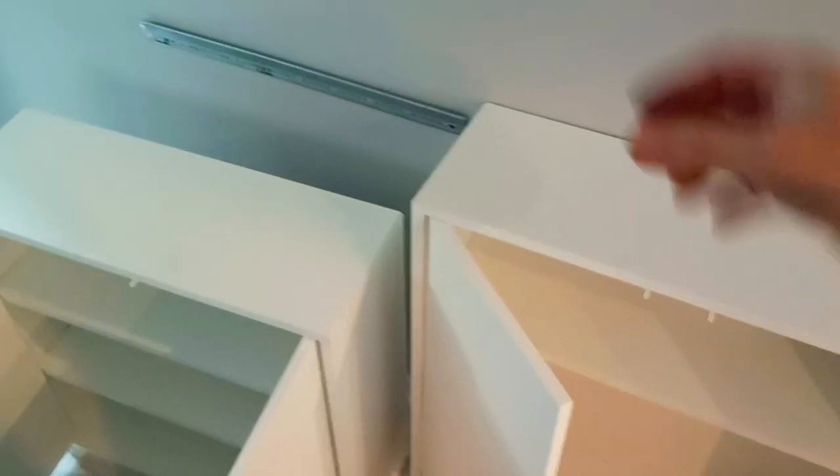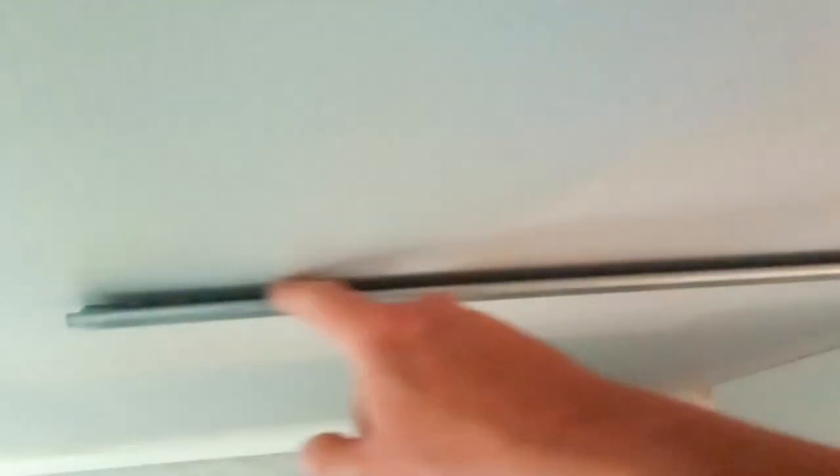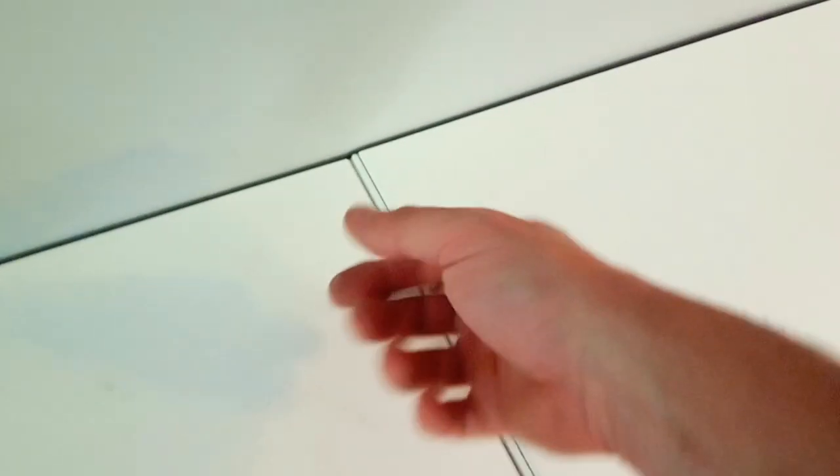Three of the screws are in, so now let's put on our cabinet. When you're putting the cabinets on your rails you're going to hear it click. The idea is to put the screws behind here and have it click — you can still slide it back and forth. Bring the cabinet against the wall, bring it down, and click, click, click. Now I can still move this and bump it against the other one. If the level is a little off, lift it out and use that knob to raise it a little bit so it will be nice and level.